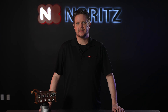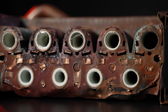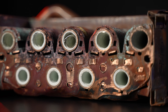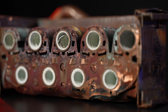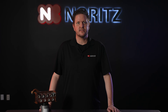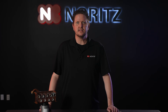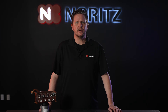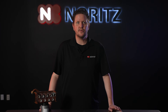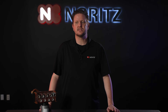As you may have guessed, scale buildup is the most common cause of an Error Code 14. Scale acts as an insulator and reduces the transfer of heat from the burner into the water. Reduced heat transfer means the surface temperature of the heat exchanger rises significantly. Eventually, it gets to a point where the surface temperature gets too hot and the thermal fuse breaks itself to prevent further damage to the unit.